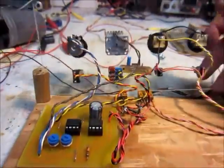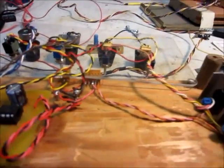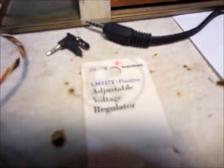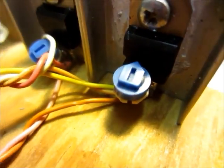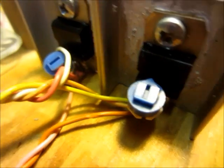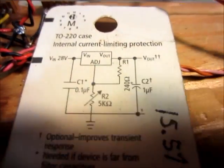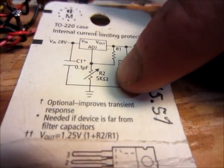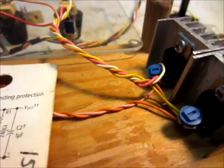It's pretty simple. I like this construction — it's just plexiglass and wood, it looks really cool. Over here we have two voltage regulators, adjustable LM317 positive voltage regulators. There are two little trimmer pots on there, and those are 5K. I had to use those because normally on the circuit you would use a 240 ohm resistor right there, but because I didn't have any 5K potentiometers — I only had 10K — I think that's why I had to go with 5K trimmers. That just adjusts the fast and slow speed.